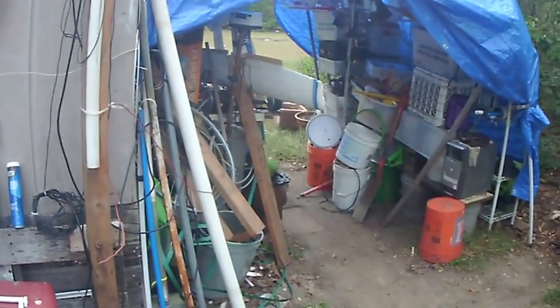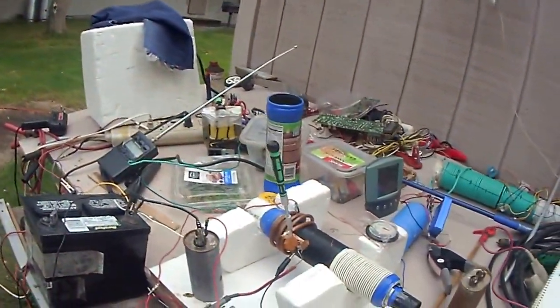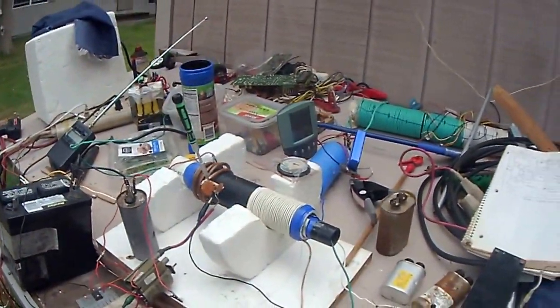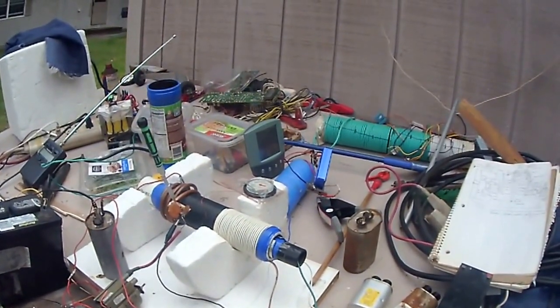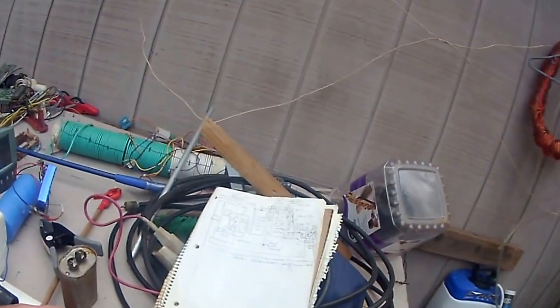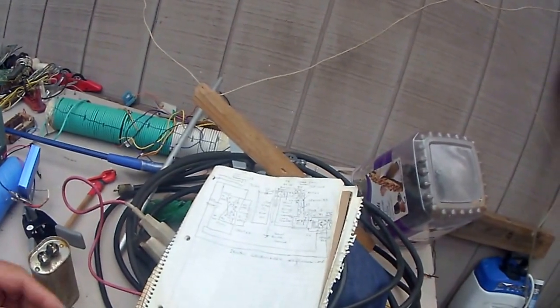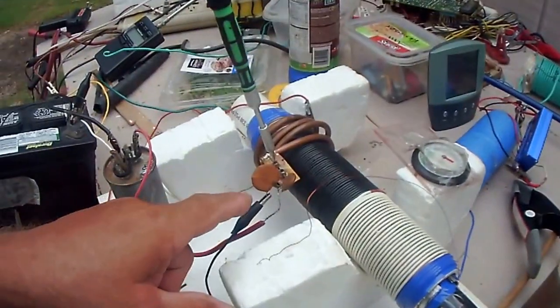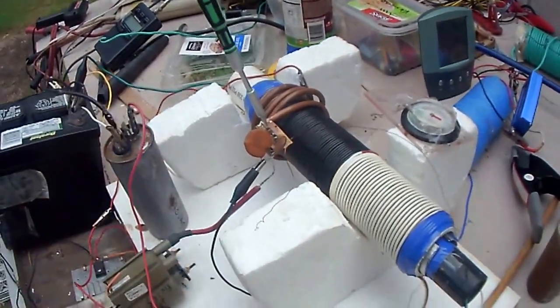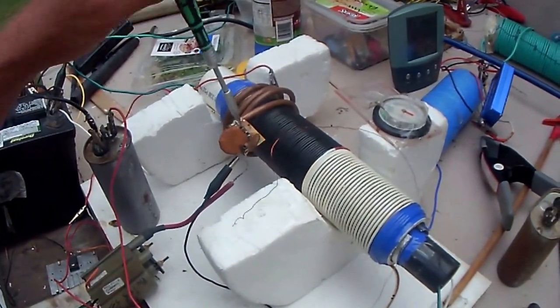Unless they use a special cap — I noticed in a lot of their videos it was a special Russian capacitor. They don't even look like any of these things. It must be set up for a certain capacity and voltage. They say 0.5 microfarad, 2 to 10 kilovolts, or 5 microfarad, 1 kilovolt. And the little one that goes on there, I got 100 nanofarad on there. That sounds right to me.